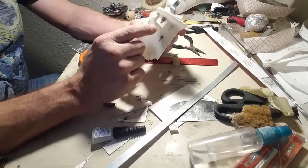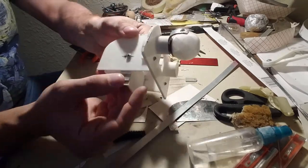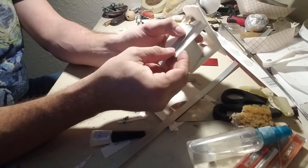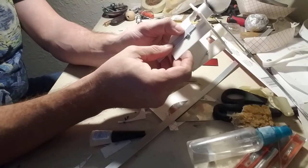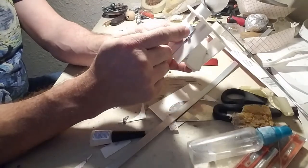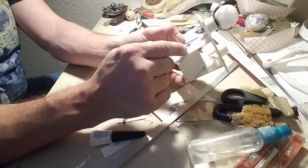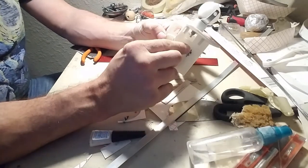I want to put some supports here because even though this is 3D printed, I don't want to rely solely on the strength of the 3D prints. As you can see on the mouth, I am reinforcing all of it — especially where the screws go in — with some aluminum. I'm going to take a little piece of aluminum, put it in, attach it, throw a couple of screws through it and drill the holes so the screws are going in through the metal. I'm worried that over time the screws will start wearing the hole bigger inside the plastic, or the layer lines could bust. That's why I want to get that support.